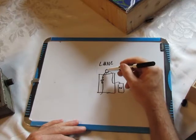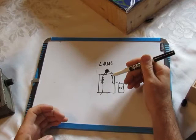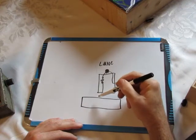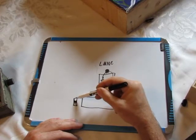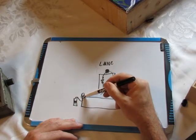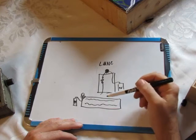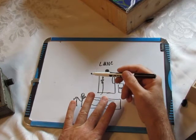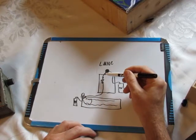And controlling this little knob basically just modulates the tone, and the touch plate is the thing that controls the tone. So basically it is also 9 volts, but the circuit's even simpler. It's just a variable resistor and a capacitor between two of the legs connected to this copper filament on top of the fiberglass board, so that when you complete the circuit, it controls the voltage of this oscillator.